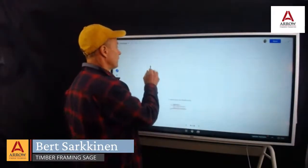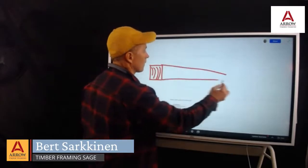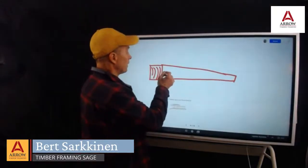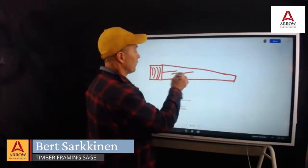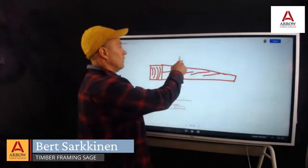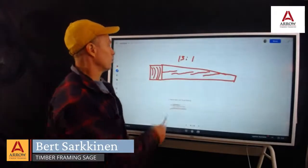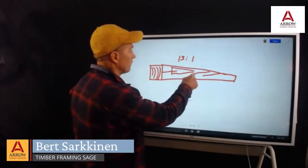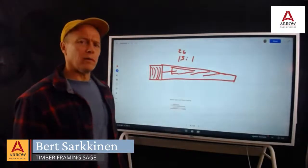Spiral grain occurs when, I'm just going to draw a beam here, and this beam is free of heart. But if there's spiral grain involved, you'll see checks. Free-of-heart timber won't check big, but you see checks that kind of take off and overlap. And this is spiral grain. I believe the ratio of 13 to 1 is what's acceptable. In other words, 1 inch up, 13 inches over. It might even be 26. I should know that better, it's been a while.